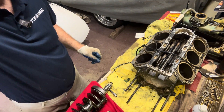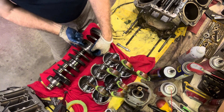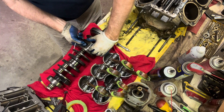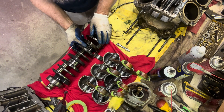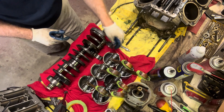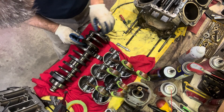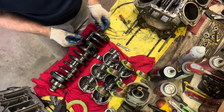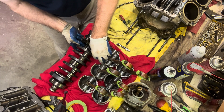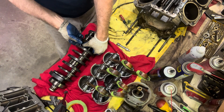Let's take a look at these bearings. With my main bearings, I want to take them off and put them back on the same way. These have a little split ring around them that holds them — sometimes you can take a little screwdriver and push it out of the way, and then it splits into two halves. This looks really nice, and the journal looks good. I'm going to put this in its right orientation and spin this around just to make sure there's no damage I'm missing. I'll definitely be cleaning all this and wrapping it in a new rag. I'm being careful to put these bearing caps or races back in the exact same way that they came off, then we'll put the ring back on.